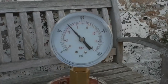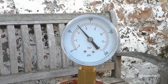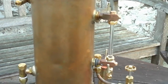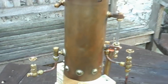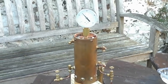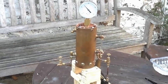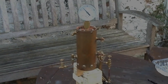The pressure gauge is sitting pretty at a tiny fraction over 70 psi. It's not moving — there's no sign of any leaks anywhere in the system. Water gauge full of water, everything tickety-boo. This is a great moment for me because basically what it tells me is I have a viable boiler, and I can say that now with confidence for the first time after many months of work, trials and tribulations. The next stage is its first steam test — live steam, here we come!